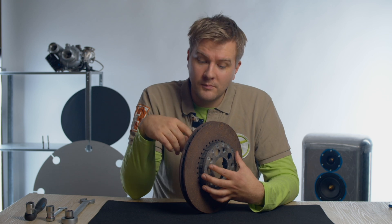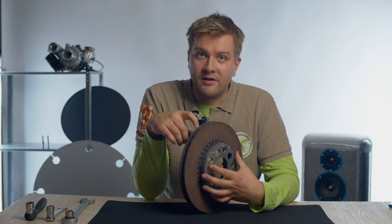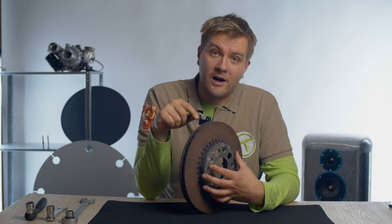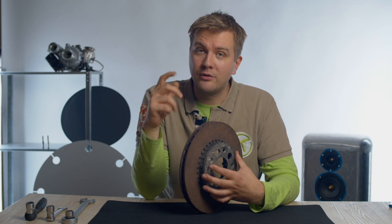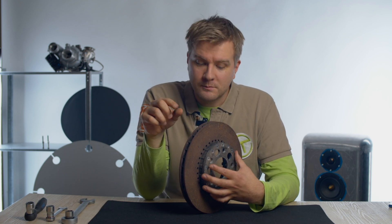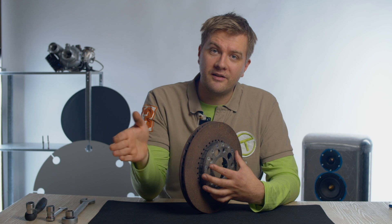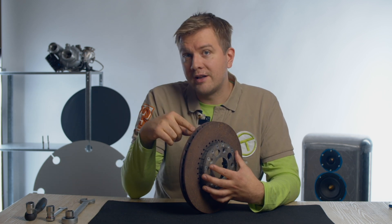I test all my own products and innovations in my own cars. I need to be sure that they work. So I tested these rotors for 10,000 kilometers in my Audi A4. I found some pretty interesting results: in moist weather the brakes actually got about 20 degrees Celsius cooler than normal steel rotors in the same braking test. But in hot weather, like plus 20 degrees Celsius, they cooled down faster — though not fast enough. If I accelerated to 140 km/h and braked to a stop repeatedly, the temperature started to exceed 400 degrees Celsius.